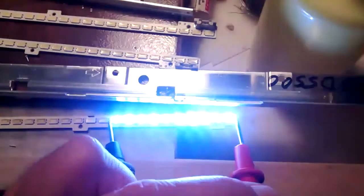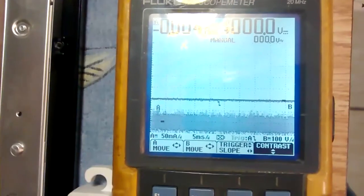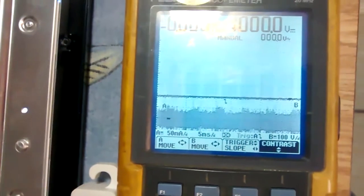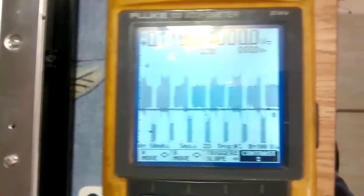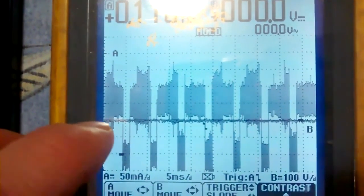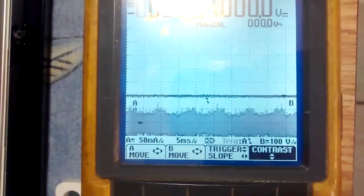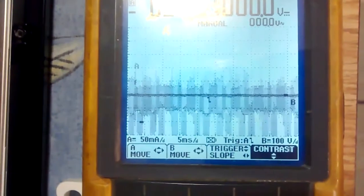After that is done, all the LEDs have to be tested again. Last but not least, I am going to lower the LED current. Here I put another resistor in series — the blue one is the original, and then I put another small resistor in series. The original peak current is about 150 mA. When I remove the jumper on the additional resistor, the LED current will go down to about 70 mA, and it's still bright enough.